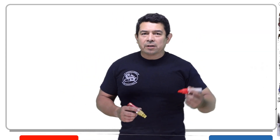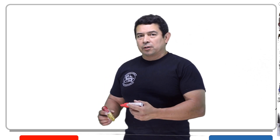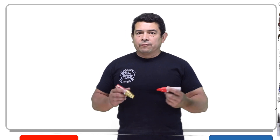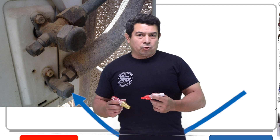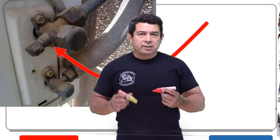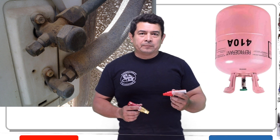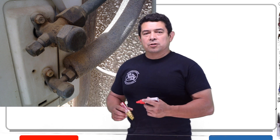When you put that liquid refrigerant into the suction line — because as the unit is running, you're going to add the refrigerant onto the suction line. If you try to add it to the high side, it's not going to go in because the pressure is higher on the high side than it is in the bottle. So we want to add it onto the low side, which goes directly to the compressor, to the suction side of the compressor.